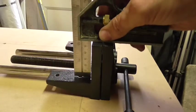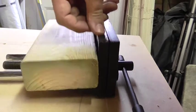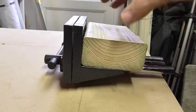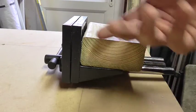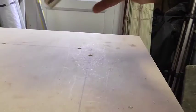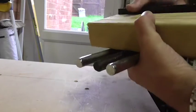The depth from the top to where it fixes on is 61 millimeters, so I'm going to have to put a piece of wood in there that's deep enough — 61 millimeters — because I want this to sit flush and level with the top of the workbench. I found a 45mm thick piece of treated timber: the worktop is 15mm, so 45mm plus 15mm is 60mm, which is close enough to enable it to sit flush. The vice has four screw holes on the underside, so I'm going to screw into this timber and then screw through the top of the workbench into the timber to secure it.